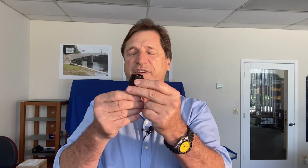This flow control mechanism has a reservoir, which is just a hollowed out area inside this Delrin body. Water fills this unit and then it is automatically drawn down by gravity through the outlet. This happens at a consistent rate. So the water always exits from this flow control mechanism at the same rate. So this is really the critical point. I won't take this apart and go through the whole thing, but it's simply a mechanism that will fill and then automatically drain. There's no moving parts.